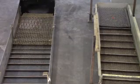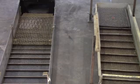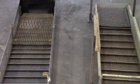These are just some of the modifications I made to these two boxes, and it's worked out great on both of them. I get very little gold down below the punch plates. On the flare jet I get a little bit more because of the way it spreads the material. On the crash box, the material hits in the front of the box and goes down the slope to the back and onto the punch plate, so it slows down a lot more, and I don't get the travel down the dredge that I do on the flare. But they still both catch really good.